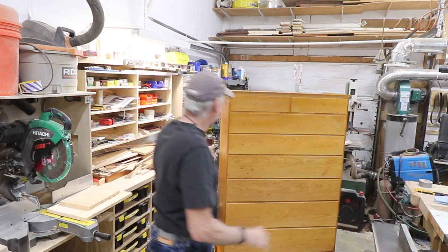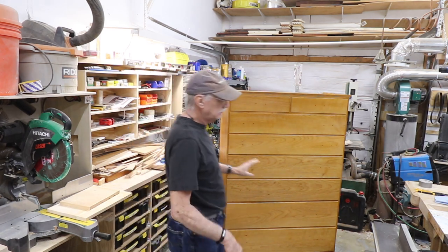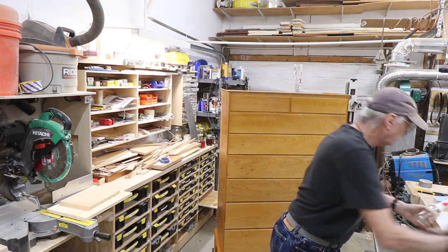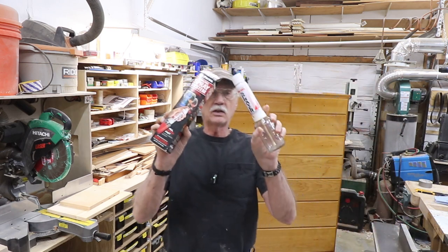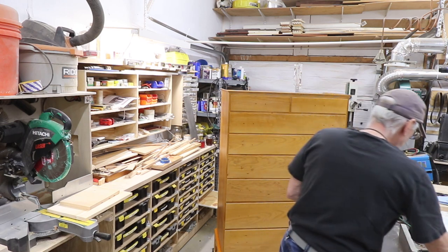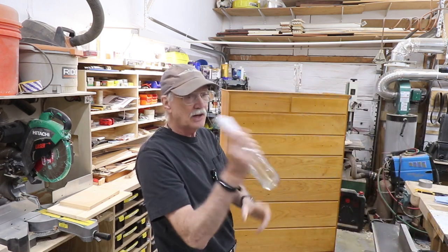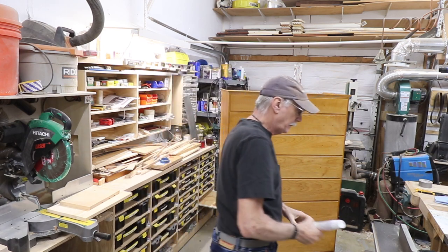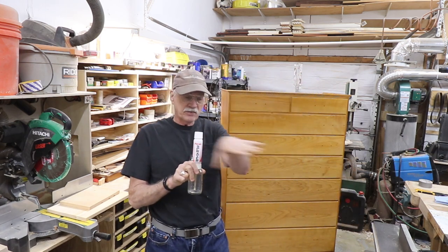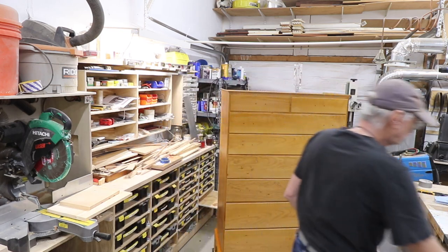So I noticed I had a few places I needed to touch up after I finished spraying with the big gun, and I use these. I've used these for years. I will put a link in the description. They're Preval little spray units. Basically, you put your medium down here. It's got a little spray can that screws on the top, and you can do little touch-ups. You can't adjust the fan on these. It's just a round pattern.